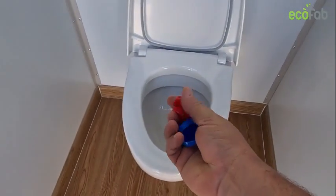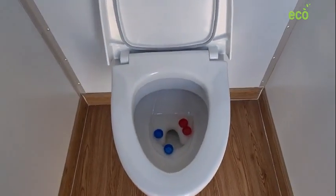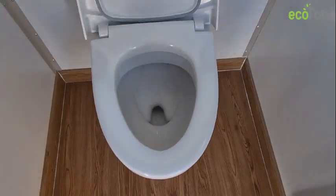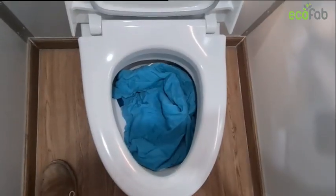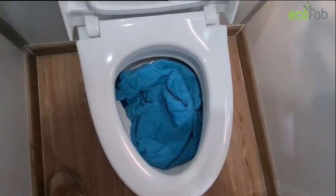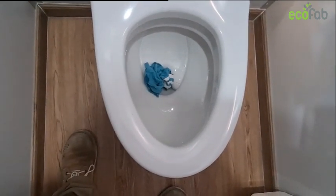The vacuum pumps run until the tank reaches the desired vacuum level and is then put in standby mode. Once someone flushes a number of toilets, the vacuum level in the tank will drop below the threshold and activate the vacuum pump to generate more vacuum. When the vacuum reaches the desired level, the vacuum pump will go into standby mode and wait for the next flush.